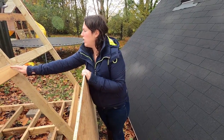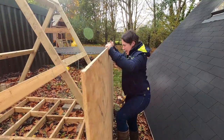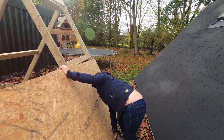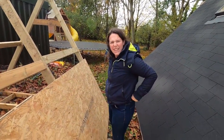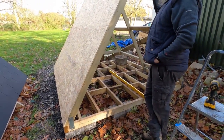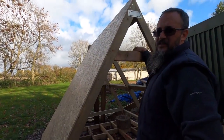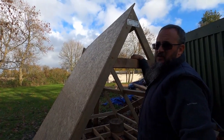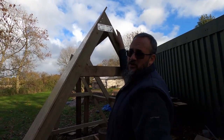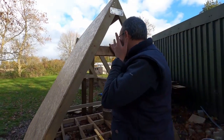We've measured these to 120 so that we've got plenty of places to screw them in. Not surprisingly, somewhere along the line we've gone slightly wrong — we should have had this slightly lower down so we don't have this overhanging bit. I wanted to take it off and start again but Brian said no — just chop it off, run a saw along the top. Put the other board up there and it'll have a much smoother finish as it butts up against it, then we can clad over the top. It never goes to plan.